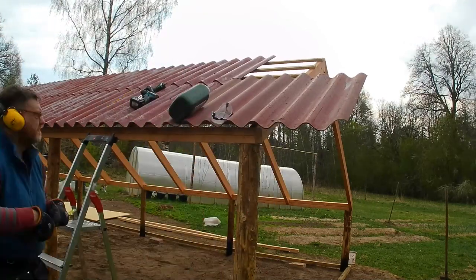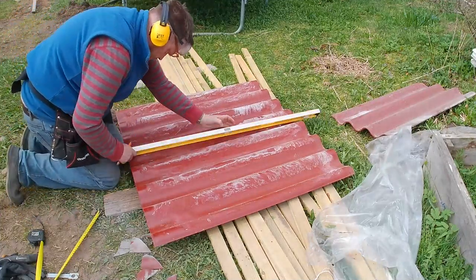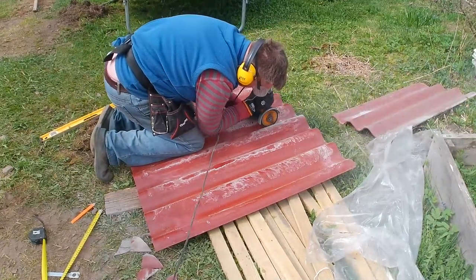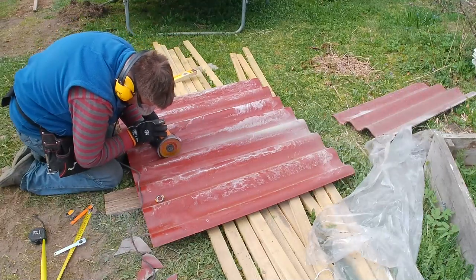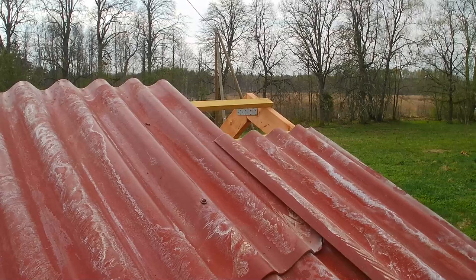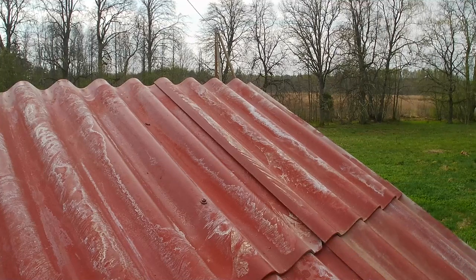Now it's the next day and we're about to put the last two tiles on. Fortunately there's not that one-centimetre-short ending, which is good. What I need to do is cut the tiles vertically to get the exact amount. You're probably wondering why I'm using an angle grinder — well, when the guys installed the main roof, that's what they used, so I thought I'd use it as well. I've gone through two or three of these blades, but it did the trick. The last tile is going on now — I need to cut an angle as it's at the end and cut the corner off. Just those last two fixings and we're done.